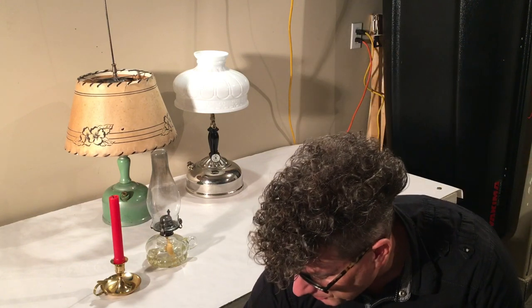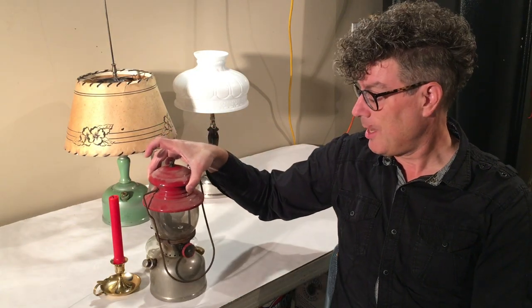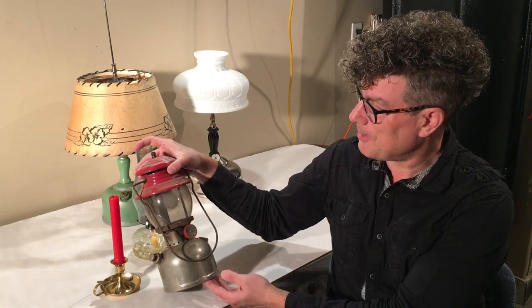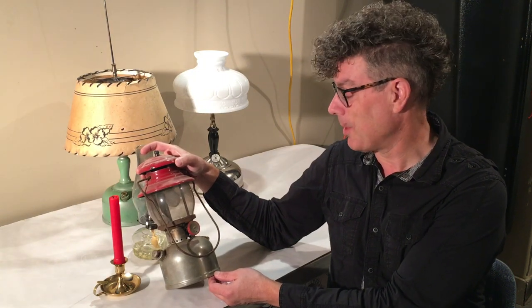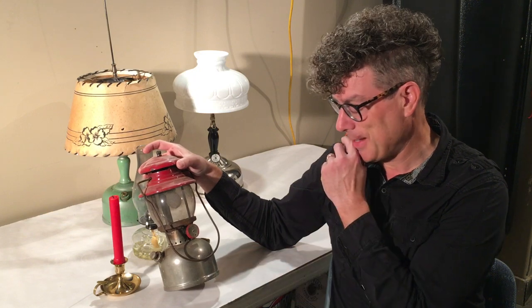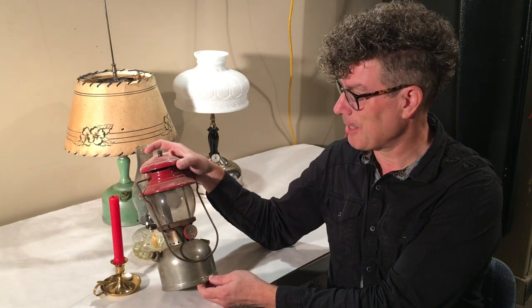The first thing I want to say: if your lamp or lantern really stinks — and they shouldn't — you may just need to clean it. I picked this up this past weekend; it's an old 200, and since it was full of fuel and the pump worked, I decided to put a cap with a good gasket on it, put a mantle on, and fire it up just to see what I was working with before I tear it down and clean it up.